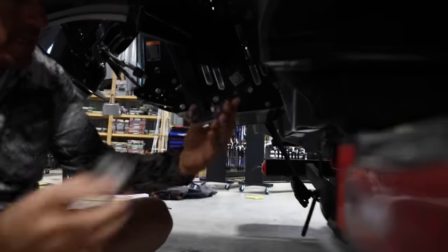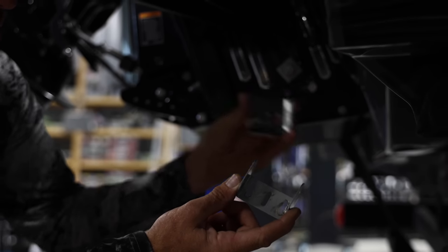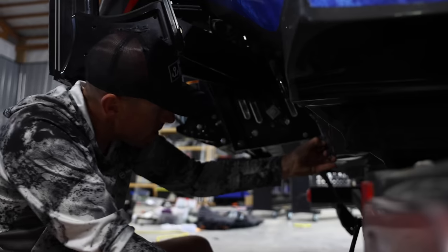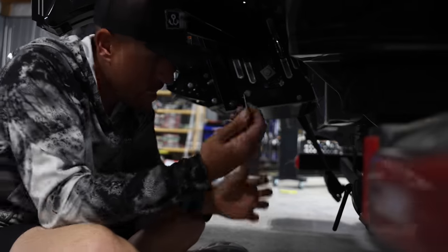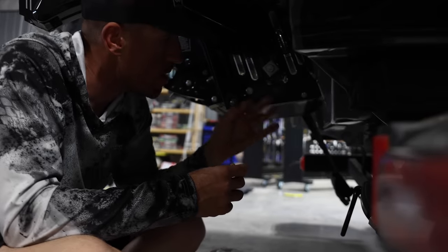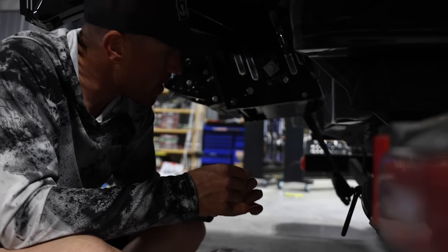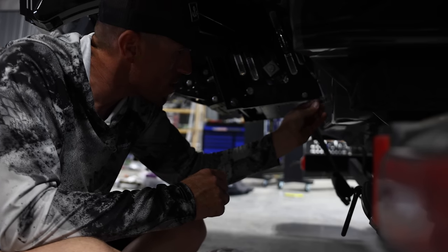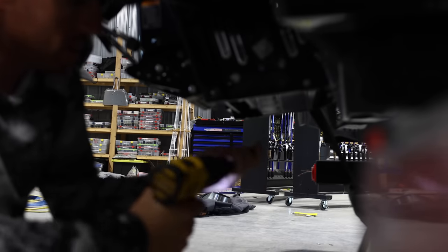Before we get into this — this bracket is a little different. If you're replacing a transducer, this bracket is completely different from the old one, so the holes don't line up. What I'll typically do if I take screws out until end of season is put a screw with some silicone in the old hole just to prevent a leak. I'd like a smaller profile screw, but I think we can get away with a slightly smaller one with some silicone.